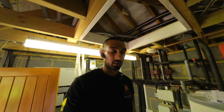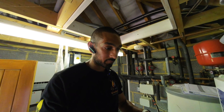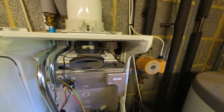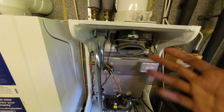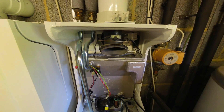Let's have a quick look inside the main heat exchanger — you can see how it narrows right down at the bottom, which is why Baxi recommend not flushing it through. If that gets choked up it means a new main heat exchanger. So literally just give it a little brush, a little hoover to get any sediment out — it doesn't look too bad anyway. I'll also flush a bit of water through the sump to clean it out, and clean the condensate trap afterwards. It's a very simple boiler to service — the trickiest part is just getting the combustion control unit out when it hasn't been serviced before.